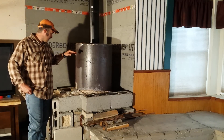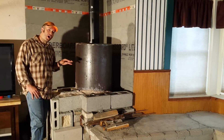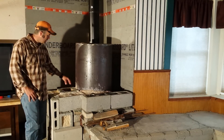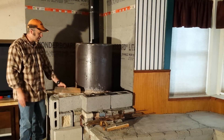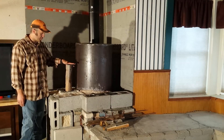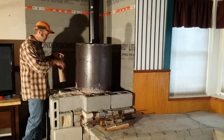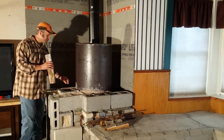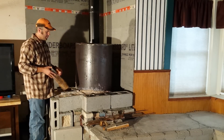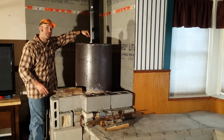What it's designed to do is basically create a controlled chimney fire, because it's burning so hot and so fast. Right down here is where the whole fire starts, and instead of the wood stacking in there like a normal fireplace — either on its side — we burn this wood from the top down, so it burns from the bottom. It's got so much draw because of the heat transfer inside that it's burning sideways. The fire's in the bottom, it's burning sideways into the burn tunnel, and then inside the barrel there's an 8-inch pipe that comes up right in the middle, so it's really super hot right there — like a blast furnace coming up and hitting it.